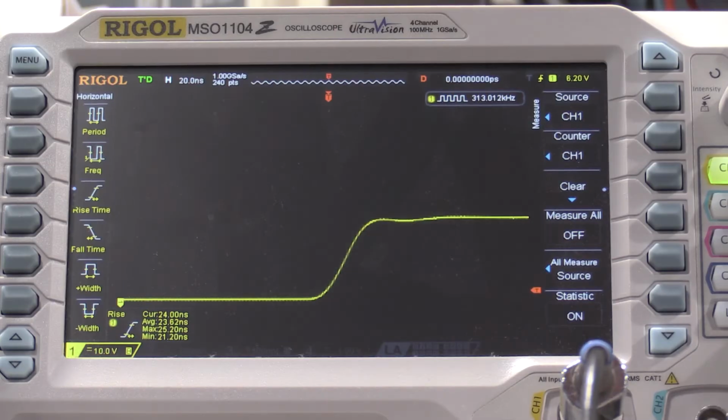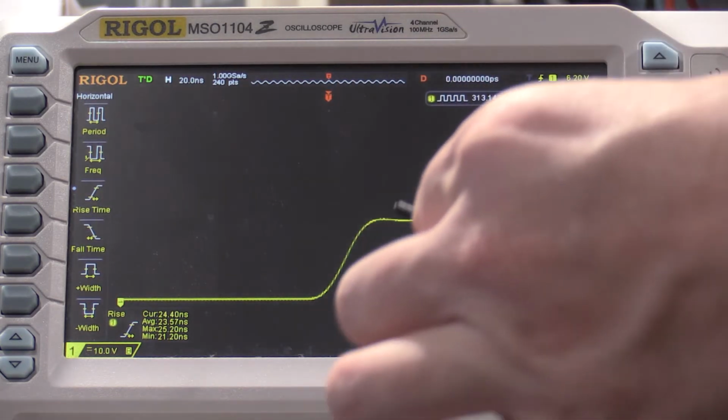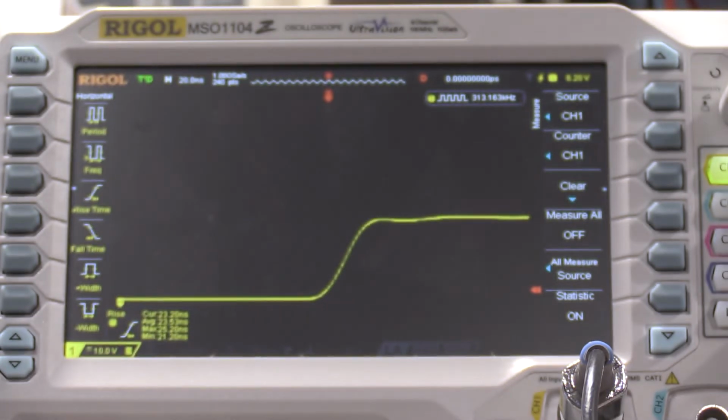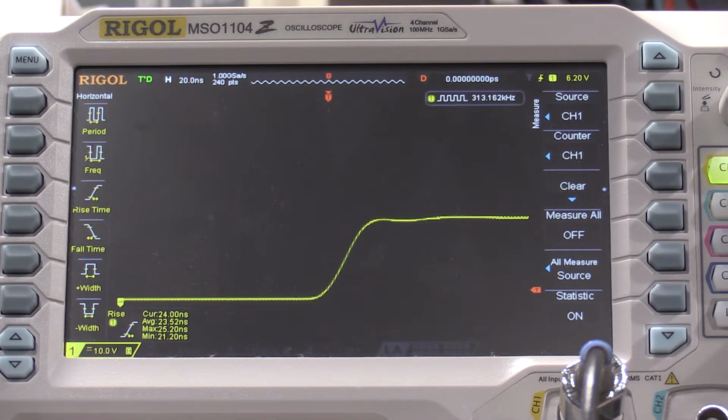Okay. So that's grid bias. All right, I've gotten the measurement set up. So we're interested in this region of the pulse. We want that to be an optimum square corner for the z-axis transient response, and you want to adjust R97 on board 41 and C109 on board 41.